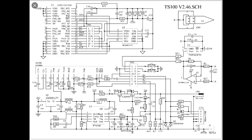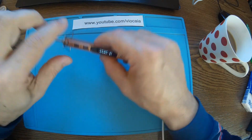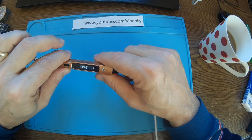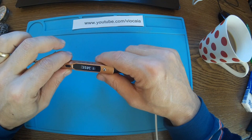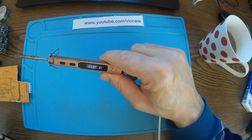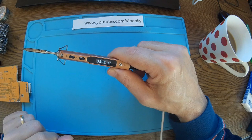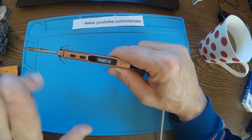I'm impressed — it's really a piece of technology inside such a small device that keeps the temperature steady and delivers power when necessary. The replacement is very easy to do. You need a soldering iron — a soft one, not too much temperature — because the ribbon is very easy to ruin by overheating, and you really need to push down the connections to the board for a strong solder joint. After one year, the display is in good shape, same brightness, working great. Thanks for watching — please subscribe, like, and until new projects, wish you well, be safe and bye bye.